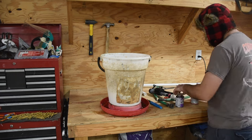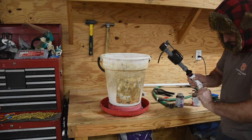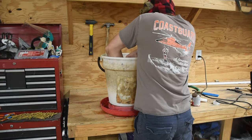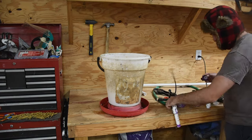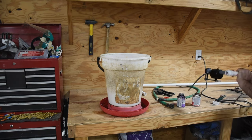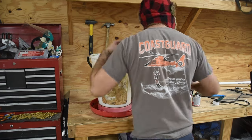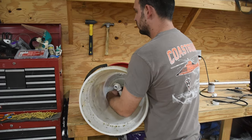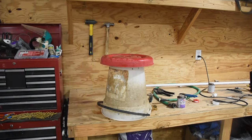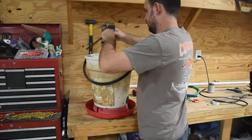At this point I made a mistake. I should have cemented the straight adapter from the threaded into the traditional PVC fitting first, then cemented the elbow in, and then twisted in the threaded portion connecting the float valve to it. I did it in reverse — I did the elbow first, then took the threaded portion out of the bulkhead fitting, cemented it on my bench, and when I went to thread it in, the bulkhead was too low, so twisting the combined PVC piece caused the elbow to hit the base. I had to untighten the bulkhead, twist it in, and jerry-rig it to get it into place. Make sure you have your order of operations correct so you don't create extra work for yourself like I did.